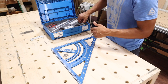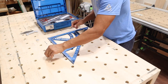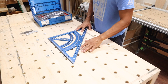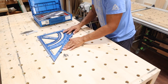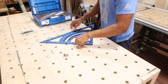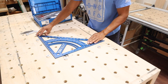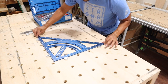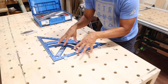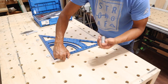One cool thing is you can test your own work if you have an MFT-style bench. You can put bench dogs into the bench — this set actually comes with some dogs. Put them anywhere on the bench and you can check to see if you're square. And that is dead on — no rocking, so I know this is square. I'm going to flip it over and check a different direction by moving these dogs to this side. Butt it up against the dogs, and you can see there's no rocking. So now I know my workbench is absolutely perfect, which confirms that when I built this bench with the PARF guide system Mark II, it was perfectly engineered and everything was 90 degrees.